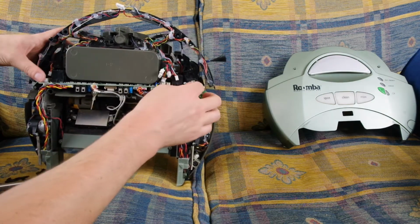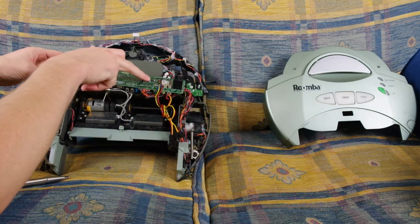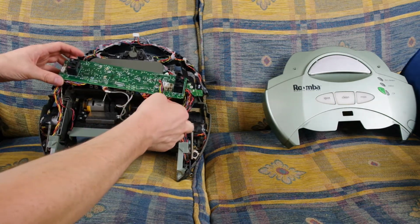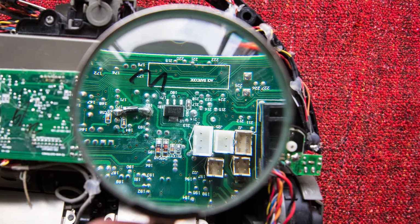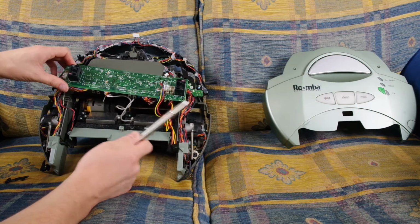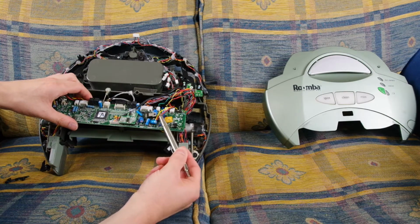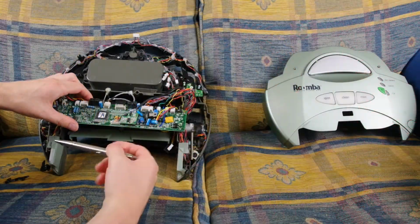And then the motherboard, you might need to give it a bit of a wiggle because sometimes this little diode here just makes everything a little bit too tight. Now, there's some wires on the board. So these wires here, this is U2, this is where U2 used to live. This blue cable here, ignore it. That was part of a fix that didn't quite work and I was trying to work out other things. And if you flip the board over, U4 is where these yellow, red and black wires go currently. And again, ignore the blue wire.